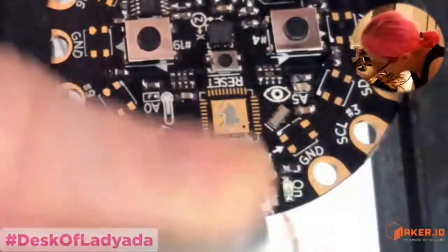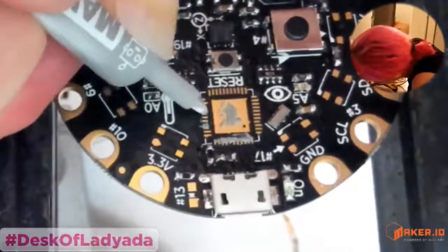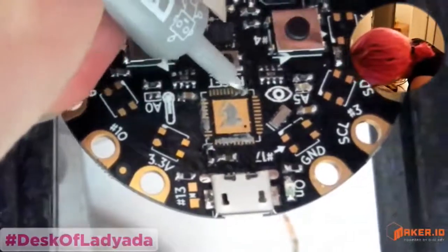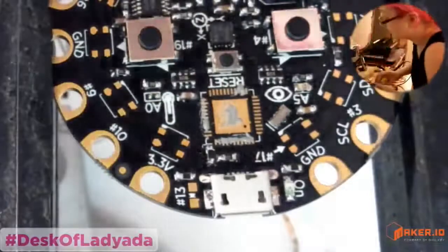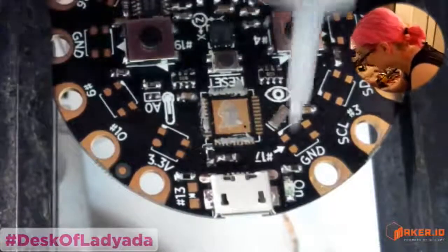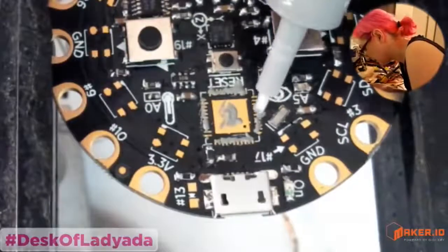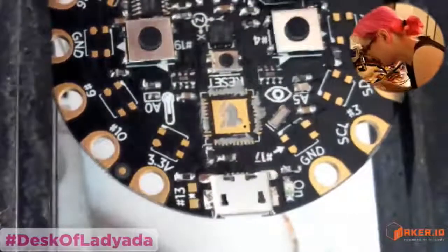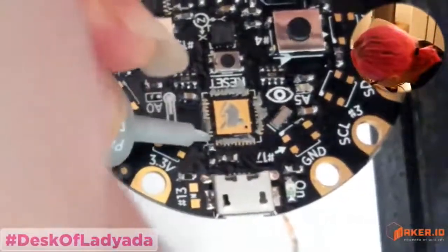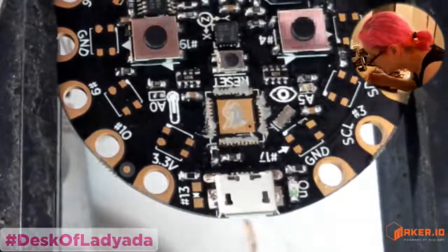And then you spread some paste. Spread some more paste. Paste. Man, I think it's hard to squeeze. You need like strength training for soldering. Okay, pretty good. And then just a little spot that I missed over here. Syringe is a little bit easier, but I thought it was worth trying this. Okay. Whew. So now I'm going to get that chip in the right location.